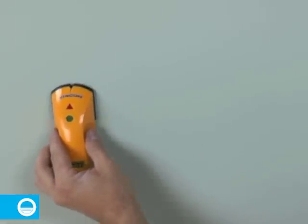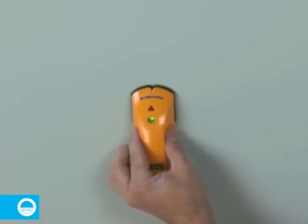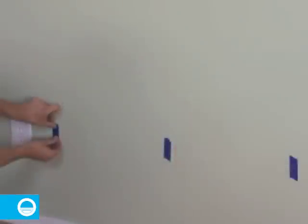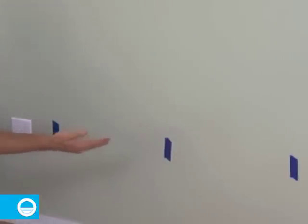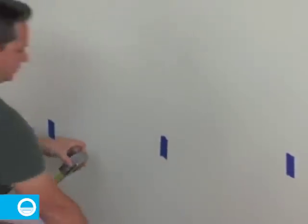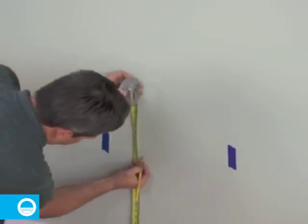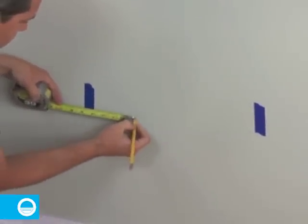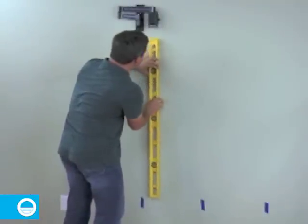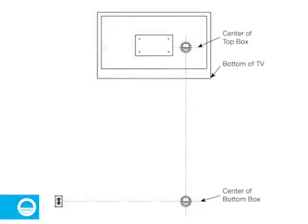Locate the studs within the wall in the vicinity of the television. The boxes need to be spaced at least two and a half inches away from any stud. Mark the nearby studs — most studs are on 16-inch centers. Occasionally, depending on the construction of the house, other studs may be present, so it's better to know where they all are before beginning. You also need to have a receptacle nearby. Place your bottom box level with the receptacle. Measure and mark the wall accordingly, placing another mark at least two and a half inches from the nearest stud. Transfer that mark up the wall to a location behind the television, and make sure the faceplate does not show after installation.